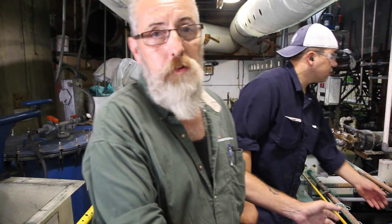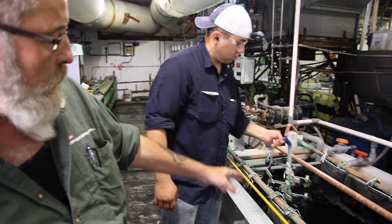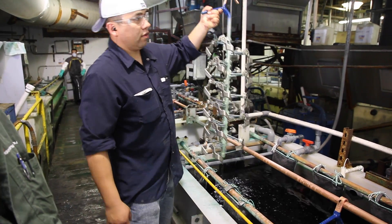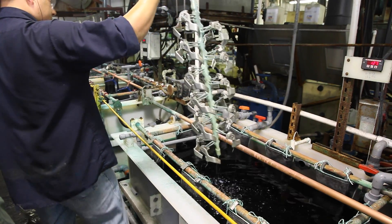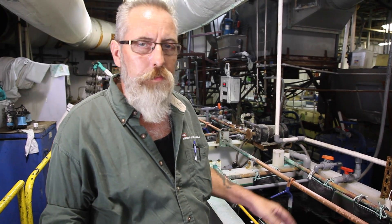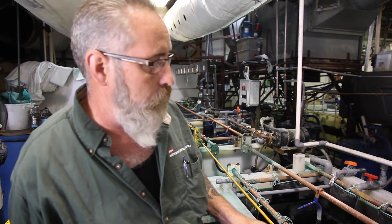As you can see right here, this is one of our many satin nickel tanks. This is getting ready to pull them out right now. This is what it looks like coming out of the tank with satin nickel on it. The equipment is a little bit different than your normal nickel tank to produce the satin finish, with several different types of agitation.